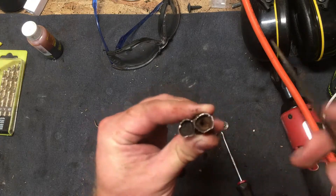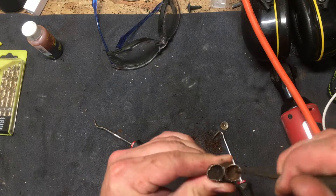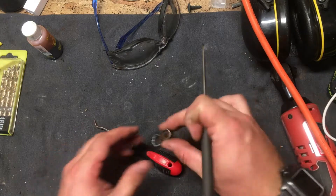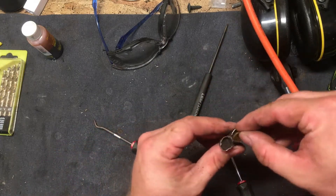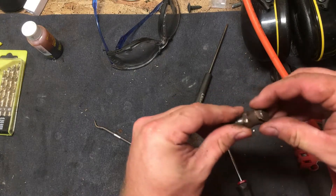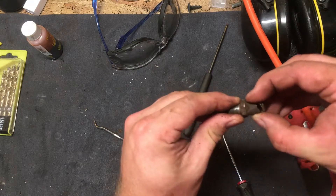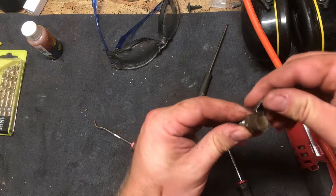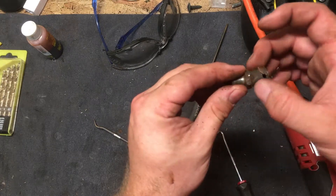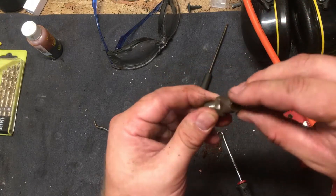So I am getting up through there. I think all that's going on here — or normally would be going on here — is this little guy sits on top here, embedded in the top of this little cap. This cap would normally kind of walk around on top, and that just acts as the check valve. It just pushes up on this cap; it's pinched in on the sides to retain it. And that's it.